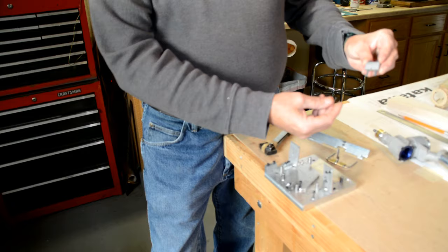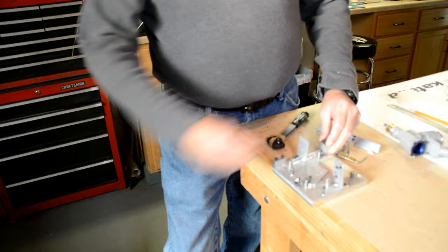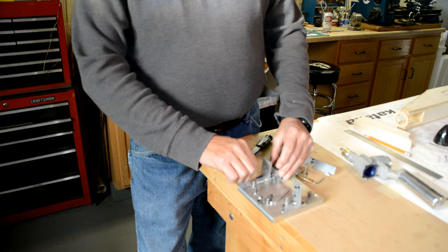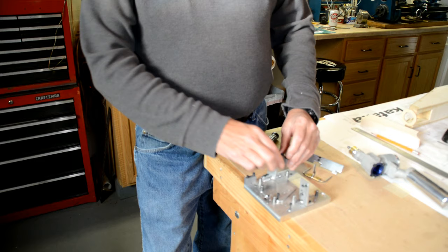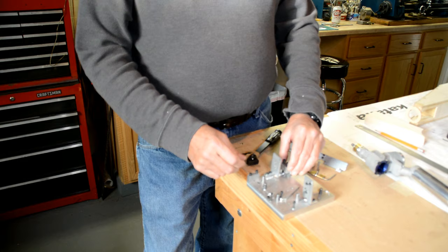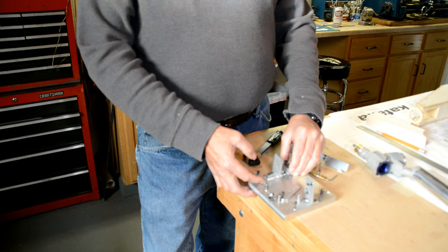And we made a little V-block, because when you make that first bend, you have to have some way of keeping that wire from pulling. So you have to clamp it to the table. So I actually made two of these little clamps. So it's sort of a belt and suspenders thing to keep it from moving, bolted to these pieces, and then these V-blocks bolted to the far side. And then we'll bend one side. Then you really don't need these much anymore, although I'll still put them on the side that's already been bent, just so it doesn't straighten out any.